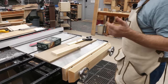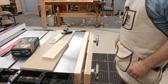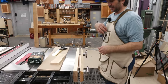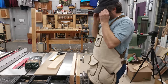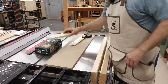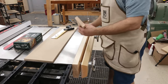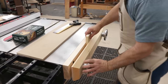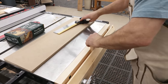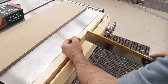Now, thanks to retired Colonel Luther Sheely, he had another idea with some springs and we added a little something to it. This is the prototype. We're going to go through and make one out of hardwood, but I just want to give you some idea of what it looks like. We used relatively inexpensive Moxon hardware from Woodcraft. We did the prototype just out of pine, but even out of pine, you put that in place and you can adjust the tension on both. And now you have a rock solid grip and you can go in there and make your cuts.